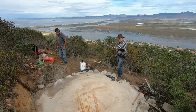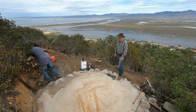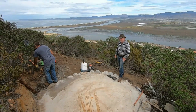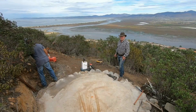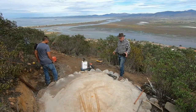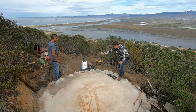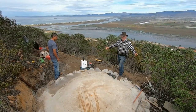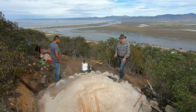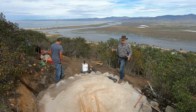It's quite strong. I would suggest with these kinds of size tanks at least a five-inch slab — four to six inches is even good to make sure you have enough strength and that it's going to last. So we start with the slab. If I had built the slab originally, I would have put rebar coming up at certain increments to tie on the rest of the ferro cement. But since we have the existing slab, we're drilling down in and anchoring rebar studs about three feet long into the slab to start our construction.